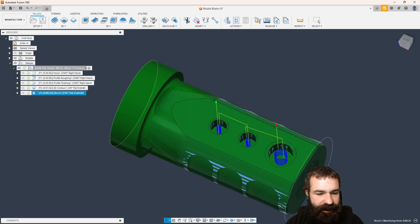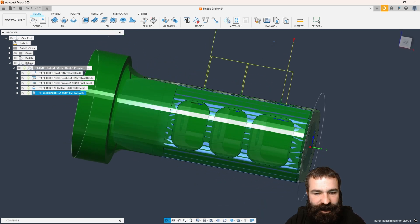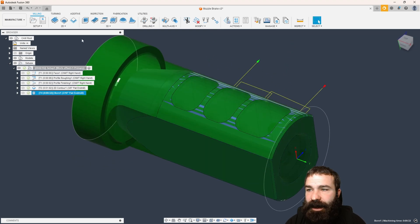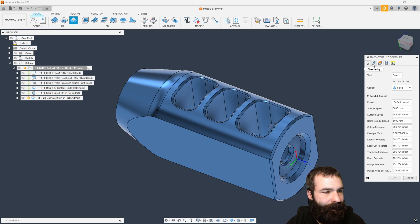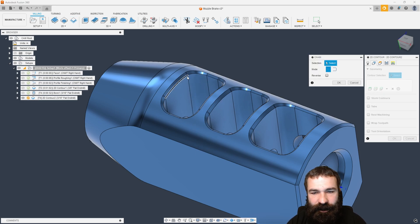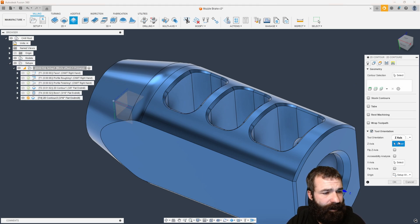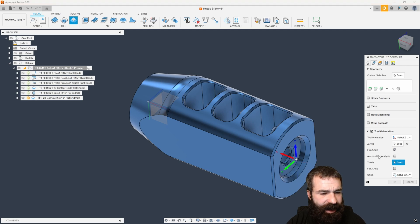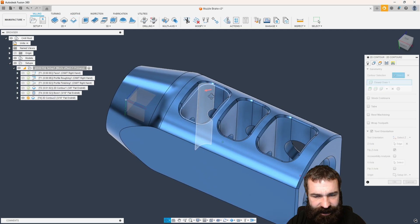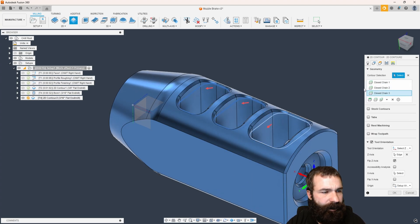Our stock is updating automatically. We don't have any weird stock laying in the middle, so it looks like that end mill is sufficient. From here, we could actually flip over to our side and start to mill our pockets. I'm going to go ahead and go back to 2D — I'm going to go to a 2D contour because I have an idea that might work out pretty well. We're going to use this upper chain around our part, so I'm going to say chain, closed chain, and pick that edge. However, I'm making the mistake of not having tool orientation set. So let's cancel and go to tool orientation.